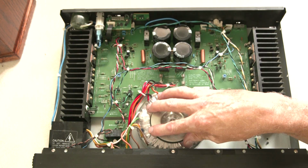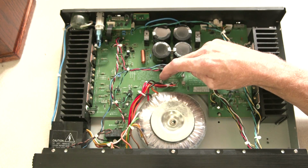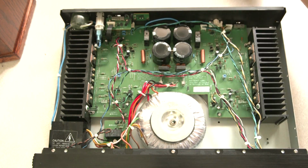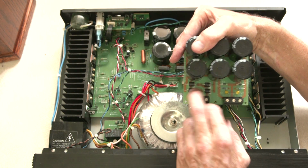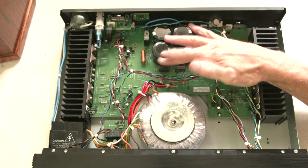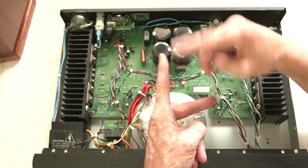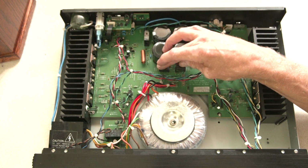Then out of the transformer, the lower voltage, 33 volts, now comes into the circuit board and through a set of fuses. And then we have to convert that AC voltage to DC, from alternating current to direct current. So we have a couple of diode packs in the power supply that Phil Marchand provides. We actually see the diodes in their individual diodes, the 4 individual diodes for the power supply. In this case, we have them this way, so they don't look like traditional diodes. But in any case, that diode pack, that bridge diode, I built bridge diodes. My father had me building those when I was a kid. And he explained all that, and I've lost that understanding. But in any case, it's got a bridge diode network, or rectifiers is what it's also called.